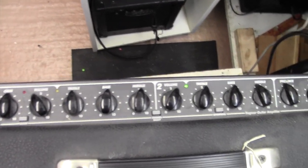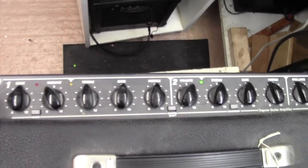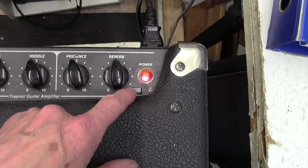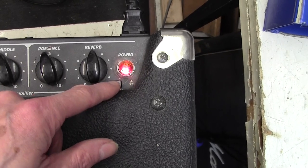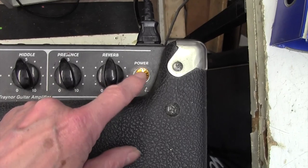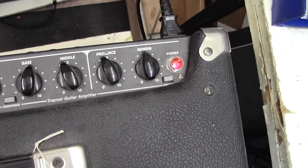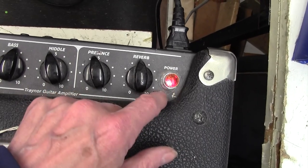Here's the amp top side — looking pretty dirty, I'll have to clean this up. I've got a guitar plugged in and as you can hear the amp is working okay. Here's the standby switch, it's just a little push button switch. Notice when I push it, the light changes, so obviously the switch itself is working. I suspect one pair of contacts is just being used to change the colour of this LED, and the other pair is being used to send the voltage off to the field effect transistor. But I'll strum the guitar and you can see that's not doing anything at all.